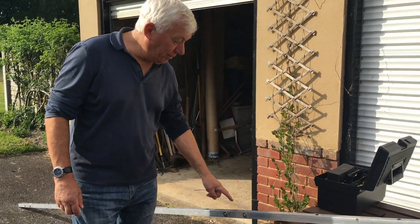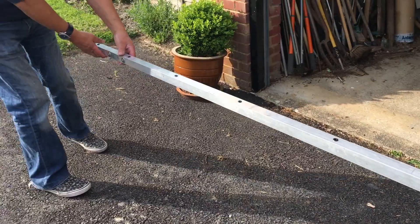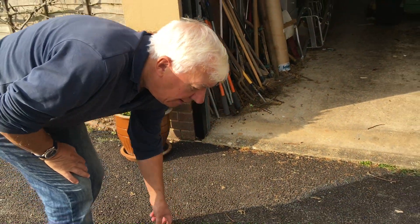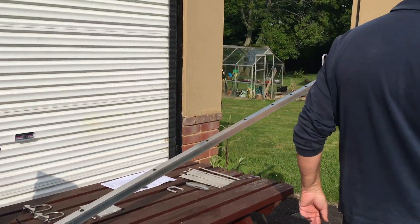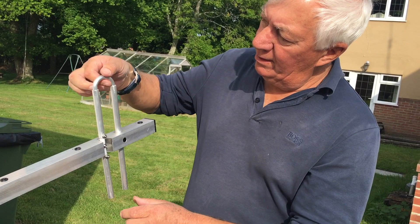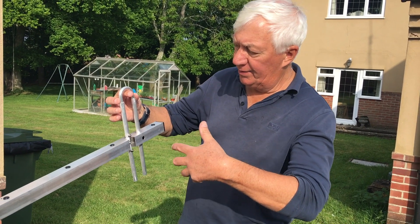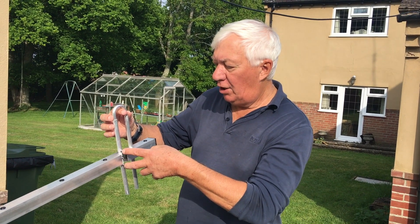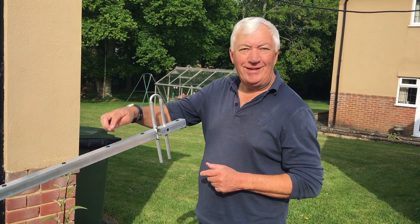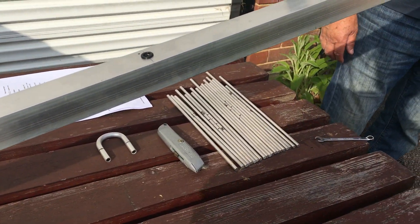So here we are. I've put the boom together. There are two joints, one here, and then there's a small section at the back here added on. And now if we go up to the back of the antenna here, I'm just starting to assemble the driven element - the loop driven element - with these tubes going in each end, and then the balun will go on there and come away at right angles. It's very important that the coax comes away at right angles. So we'll finish off the driven element and then I'll put in the other elements. They're all here, I've laid them out. They're all labelled.